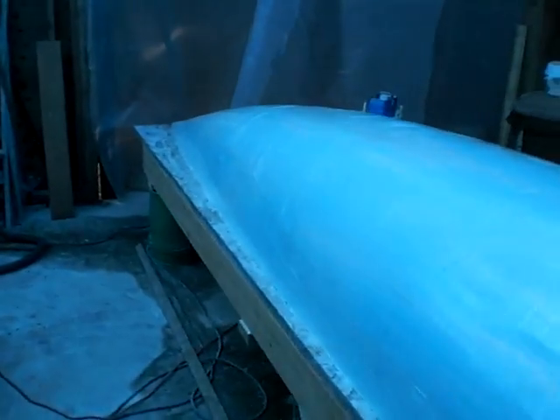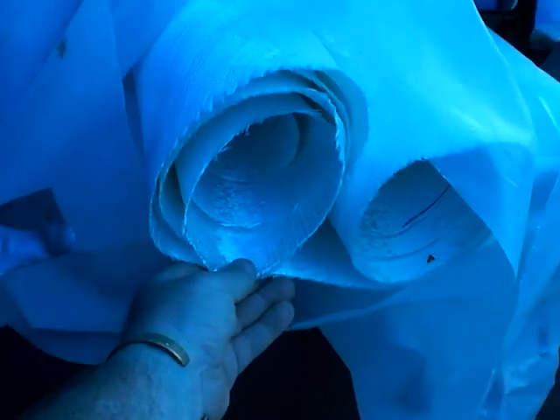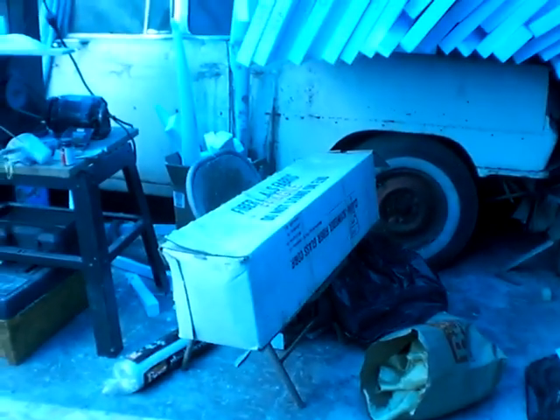Covered with mylar tape, and we have the materials to lay it up here. Two layers of tri-axial fiberglass cloth — that's this stuff right here — sandwiched between two layers of Kevlar cloth, which is that stuff in there. With three outer layers of six-ounce tooling cloth in this box right here.